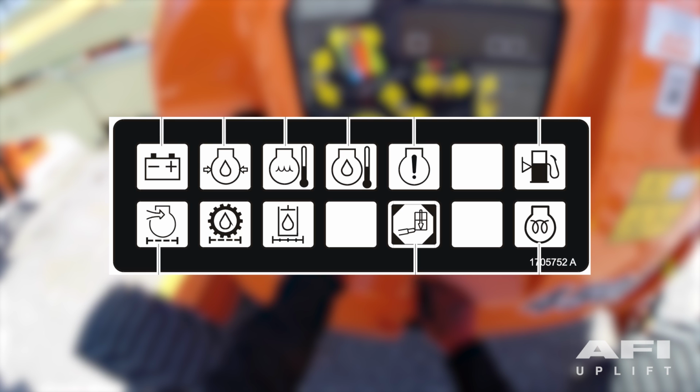Engine oil pressure indicator. When illuminated, this indicates that engine oil pressure is below normal and service is required. Engine coolant temperature. When illuminated, this indicates that the engine coolant temperature is abnormally high and service is required. Engine oil temperature indicator. Low fuel level indicator. When illuminated, this indicates that the fuel level is 1/8 full or less. When the light turns on, there are approximately 4 usable gallons of fuel remaining.